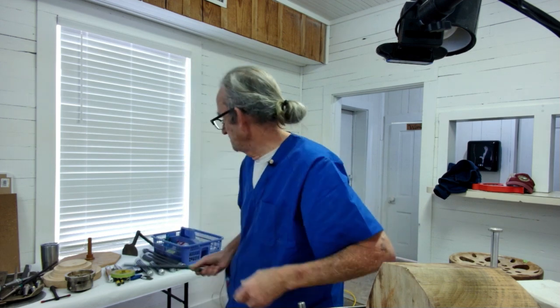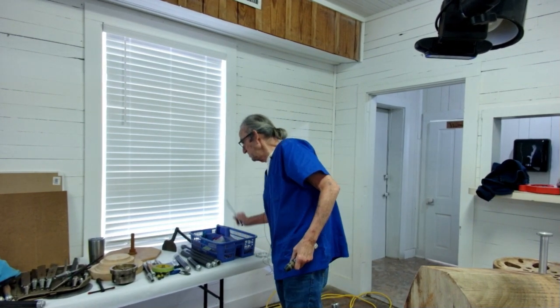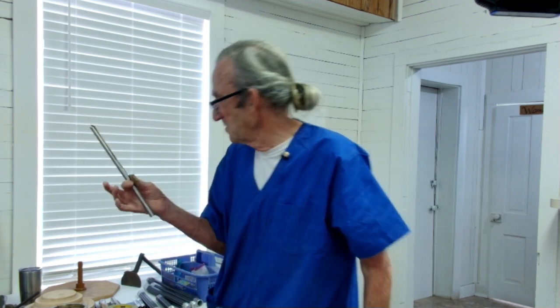But even if you just put it into a screw-in handle, it's the same thing. There are other handles. There's lots of other handles that you can put set screws on it and just use the tools loosely. You can do the same thing with that. You can put this in there and tighten down with a set screw and do the same thing with it. Jimmy Clewes makes a quick release system. It doesn't have to be the quick release. Personally, I like the tools unhandled for that reason, this is a whole lot easier to sharpen than something with a long handle on it.